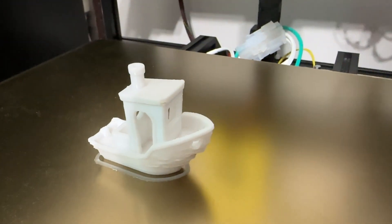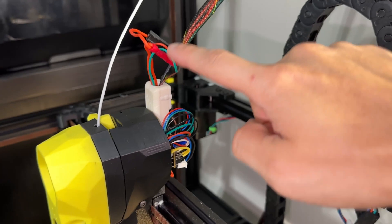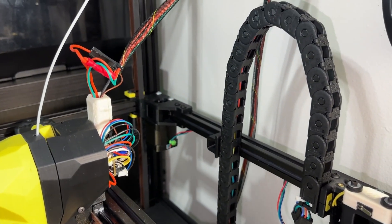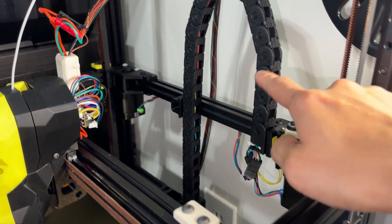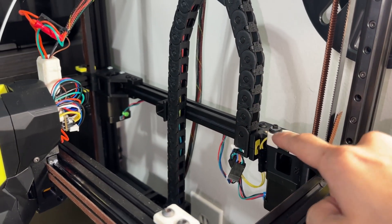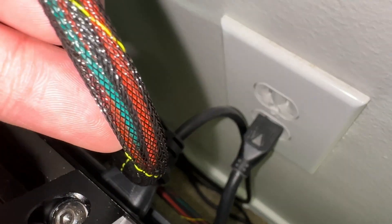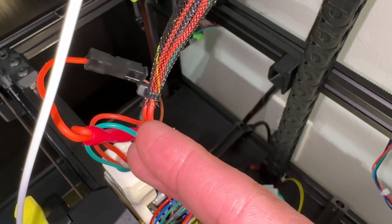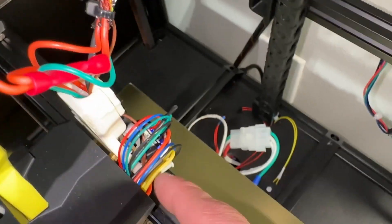14 is a weird number, so here is mistake number 15 and purely my own opinion: not going with CAN bus. You see this mentioned a lot, but even I thought it was overblown. I really do believe they will remove the XY chains in the future — it's just not feasible running that many wires and expecting longevity. The CAN setup using the octopus bridge mode was simpler than expected. Recently, due to my own mistake, I snagged the umbilical cable against the power cable — the CAN low wire was destroyed and I had to re-crimp all 4 wires on the EBB connector. I can't imagine if 18 wires got cut somewhere along a cable chain.